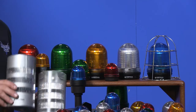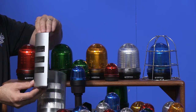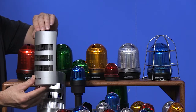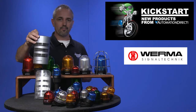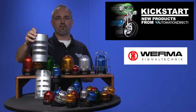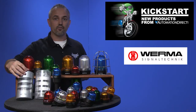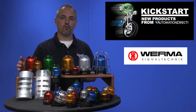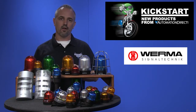Last we have our flat sign signal light. These are fixed with green, yellow, and red LEDs. They have 160 degree viewing, great for vertical surface mounting, and each light can be set for permanent or blinking. We have two styles of finishes and they are available in several voltages. Models are available with and without audible tones.